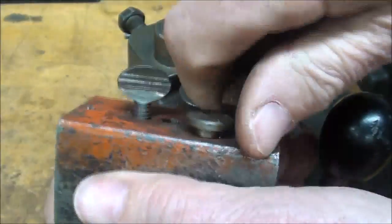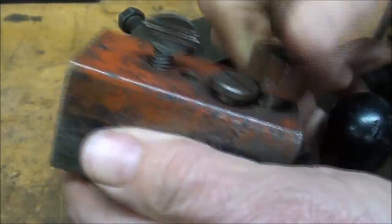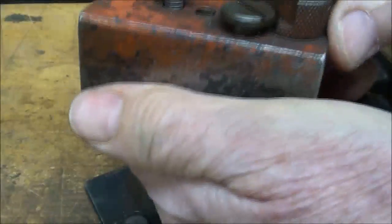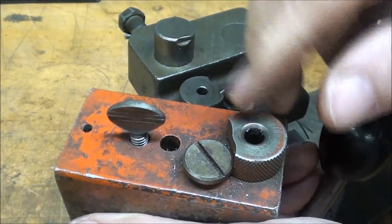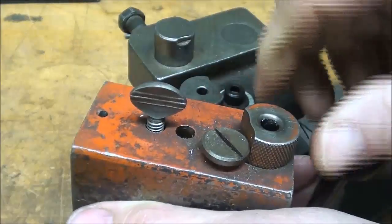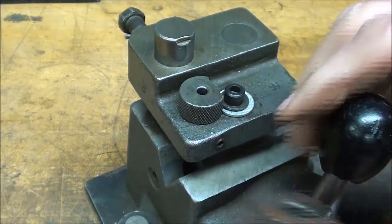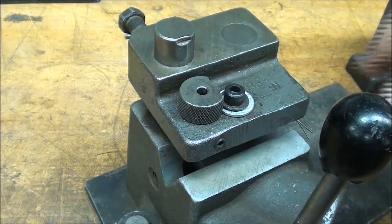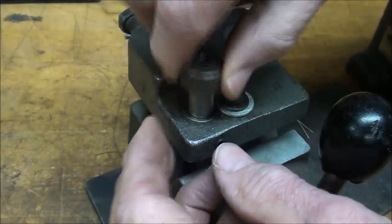There's a sleeve in there — or there should be a sleeve. That allows you to push it in all the way and then turn it, which locks it so the bushing will not spin — you don't want the bushing to spin — and it will prevent it from lifting out when you retract the drill bit. There should be one in place here and I do not have one in either of these jigs, so I'm just using a flat washer.